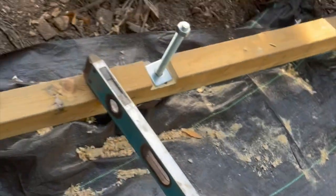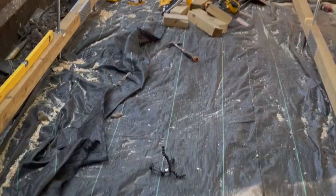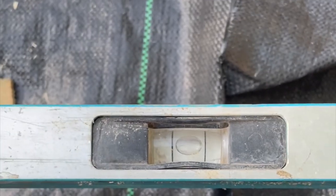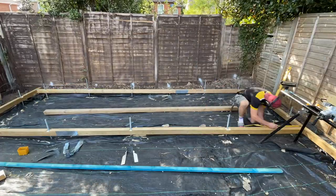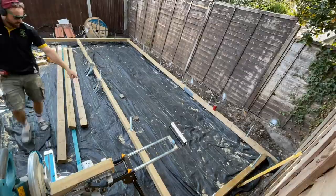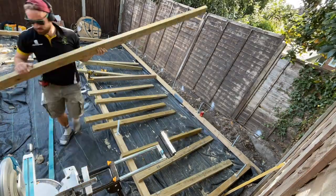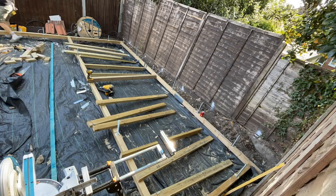You want to check that your perimeter joists are all level. I've done this with a six-foot level — as you can see it's bang in the middle of the bubble, which is one of the benefits of this system. You can see the perimeter joists all on, running through the middle, with the splice plates visible. This gives real strong rigidity, and I'm going to run the 4x2 floor joists — here's a time-lapse of that.